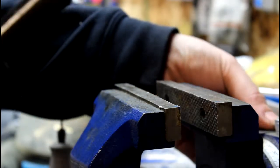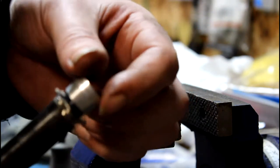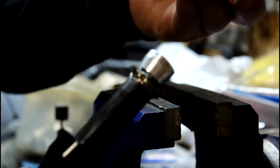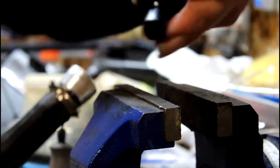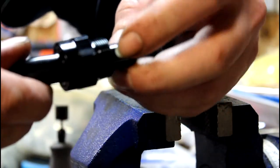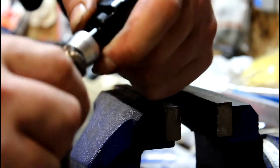Once you get it flat, you just take your collet and slide it over — you are going to see that it is tapered. You want the taper going down. Go ahead and put it on there until it sits flush. Then take your fitting itself and just slide it right into the hose. Now depending on if you have the same brand of hose as the fittings, it may be a battle to get it in there. Sometimes it is necessary to take a little sandpaper and sand it down a bit, get that coating off, and it helps it slide in easier.